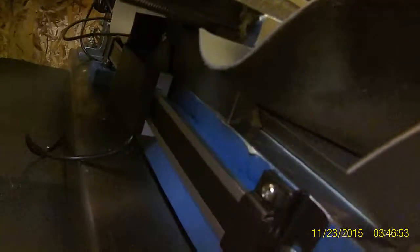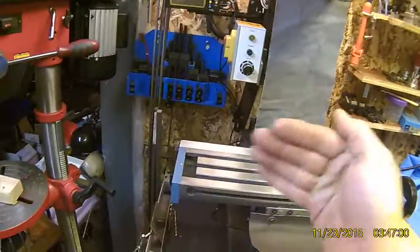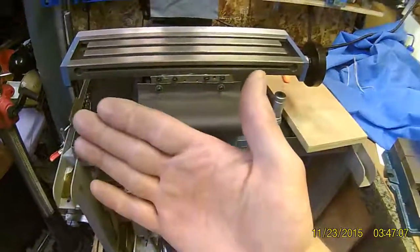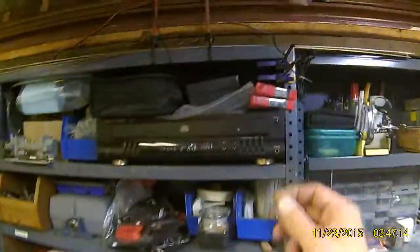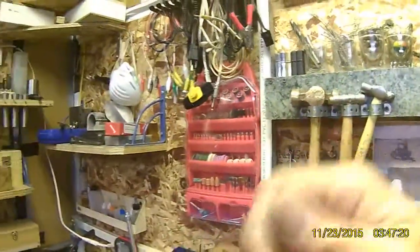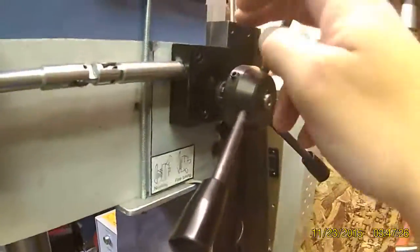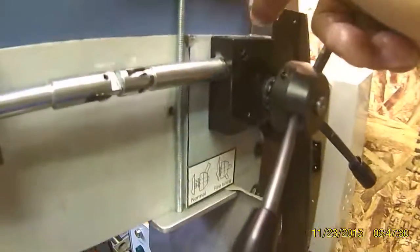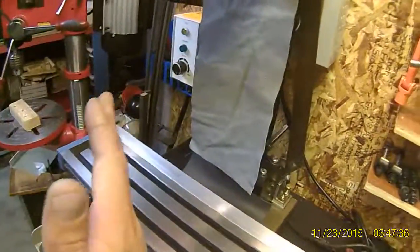All these brass pieces are bent over on both ends so they're not going to come out — they're stuck in there. The way I did it: I put the brass in, put my gib strip in, put some little rubber clamps on there to hold it all together, then tapped it over with my hammer — easy peasy. Those make a big difference. Now that I've got it all put back together, I'm going to make actual brass gibs for the other side, so I'll have two contacts of brass for the skinny part and leave the big flat surfaces as cast.